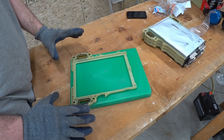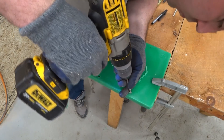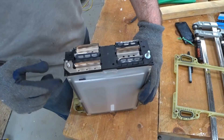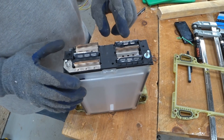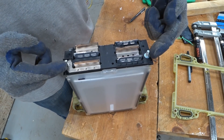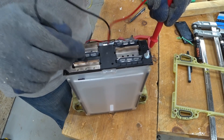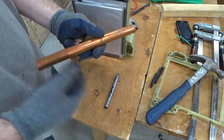I'm trying to line it up where I like it. This is the main negative and the main positive is over here. I'm curious to see if there's a way I might be able to wire from here over to a post, so I could have screw posts for the positive and negative. First thing I want to do is verify this post is not electrically touching anything else. No continuity — which is what I thought, but just wanted to verify that.